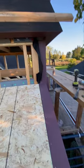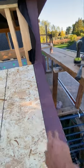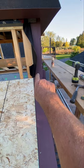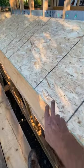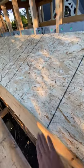Okay, so we're on a pretty short day here, tied in. Now, it's not an accident that details like this overhang, me running the gutter wild, and it abutting into the bump out window make clean details. This is where crown and overhangs terminate cleanly. This isn't a mistake. This is planning. So we're ready for our, at least in terms of ice shielding this, and we'll leave the release paper on the bottom side of this so that when I do the gutter, I can get it underneath, and that's going to be done in ice shield.